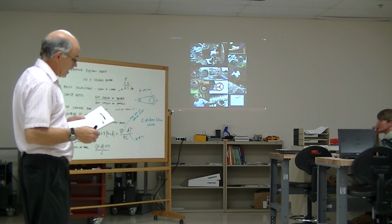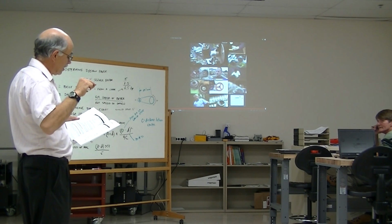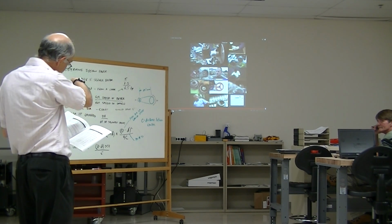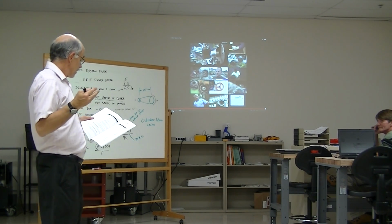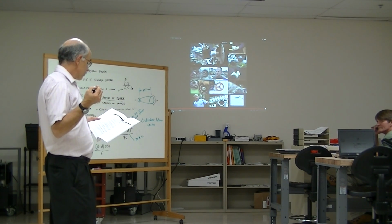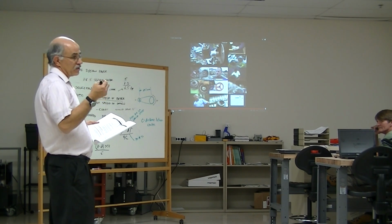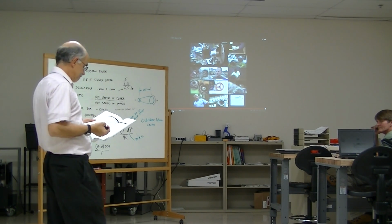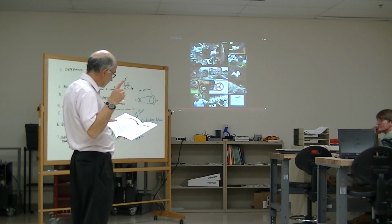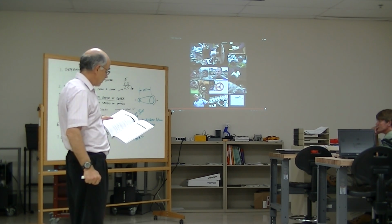And then you're going to get a loss of contact correction factor depending on the loss of arc in contact. So when you come out with this factor here, if your loss of arc in contact is, for example, 25 degrees, then your correction factor is going to be 0.93. So you're going to take your horsepower and multiply by 0.93. And then you're also going to figure out the belt velocity. How fast is the belt turning? And all that's going to help you figure out this corrected factor.